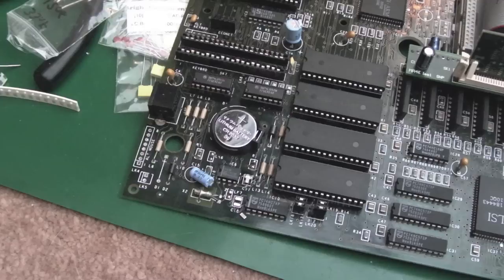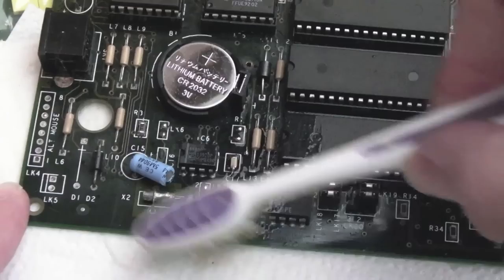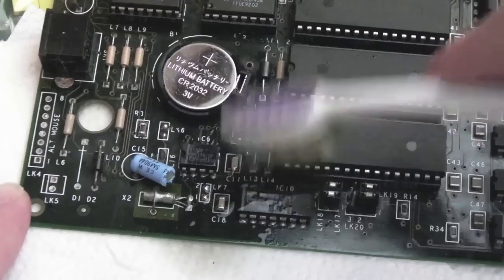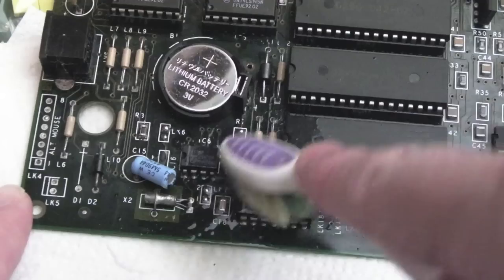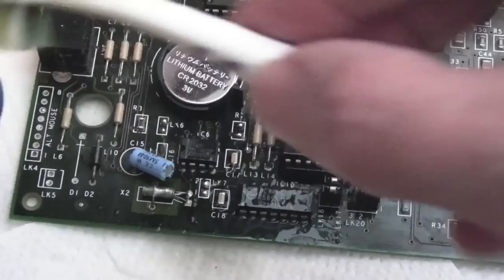Clean up. So I'll get that new op-amp in a minute. I'm curious to see if it's any louder with the original one, because I don't see what else could be causing the low volume level on this one, actually. It's definitely not those caps I've just replaced. Those won't be affecting the volume level. For one thing, I think they only relate to one channel, one side of the thing there, so you'd have a mismatch if they were, but they're not in the right part of the circuit to be affecting the volume or anything like that.